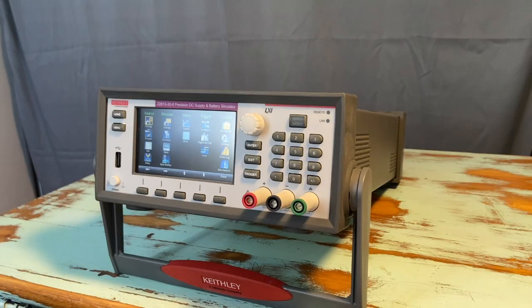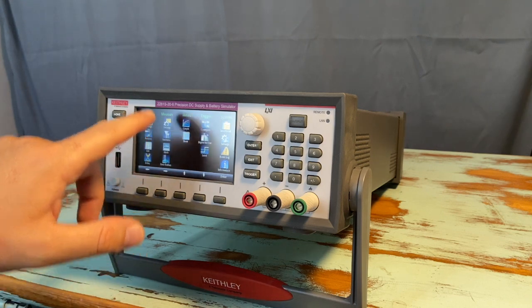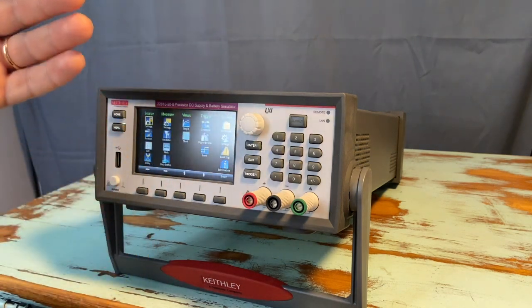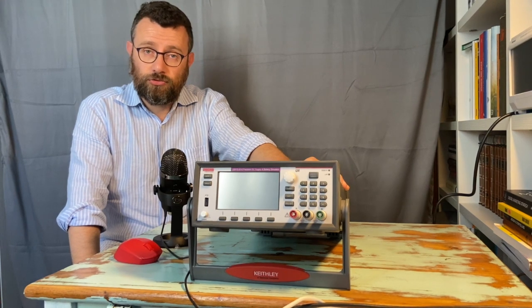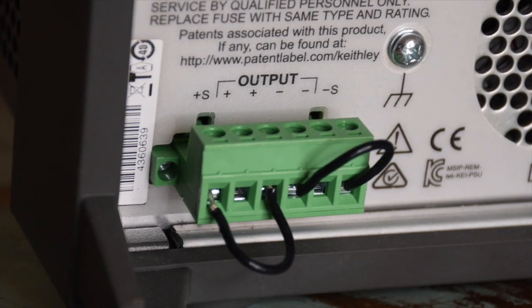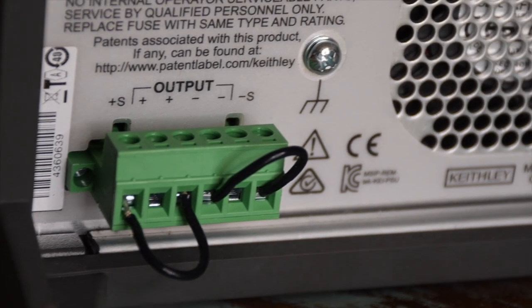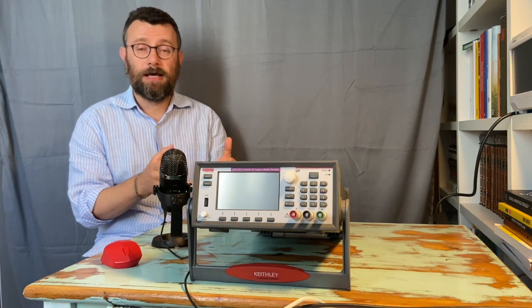I like the fact that this DC precision power supply with the controllable output resistance can be used not only to test my PMU, for instance, or my design, but really as a flexible tool in production. I like the fact that there is a software application which you can use to remotely control this unit and to program the trigger machine. I like the fact that I can set a 4-wire sense connection for this unit and the possibility to detect open leads connection. I like the fact that I can upload voltage profiles so that the unit can reproduce a sequencing mode, or the fact that I can program the unit using SCPI commands and write my own script to control the behavior of the unit.